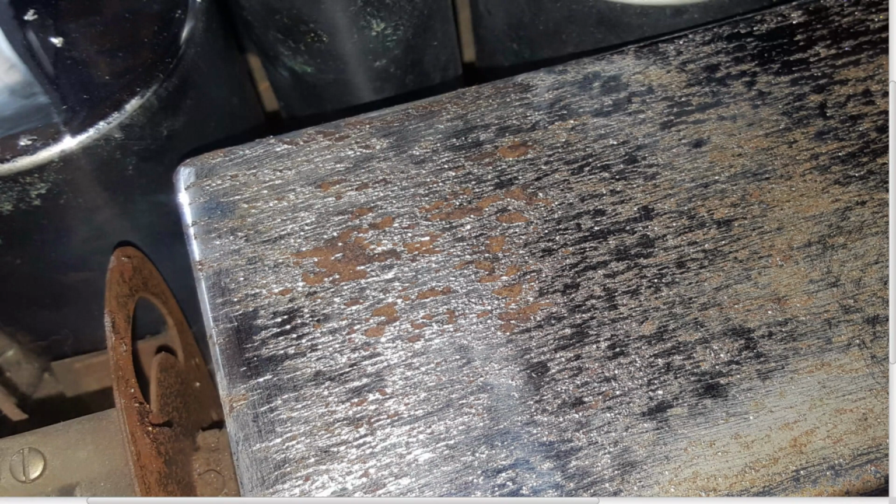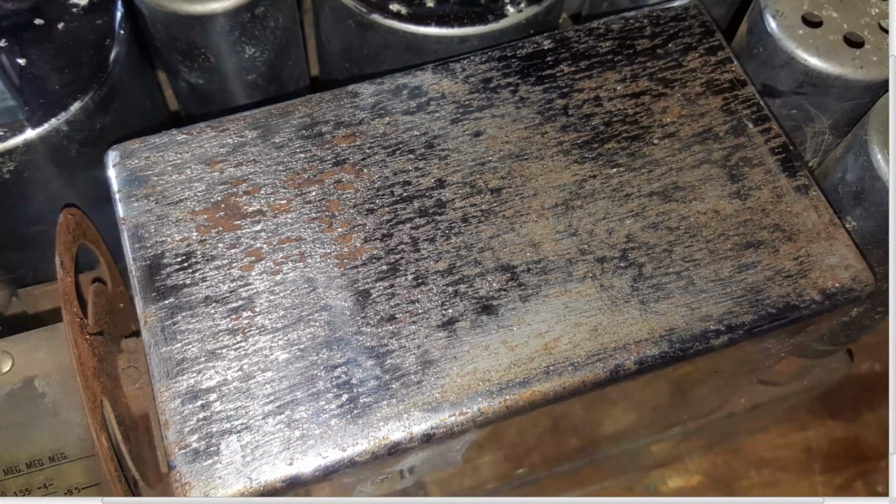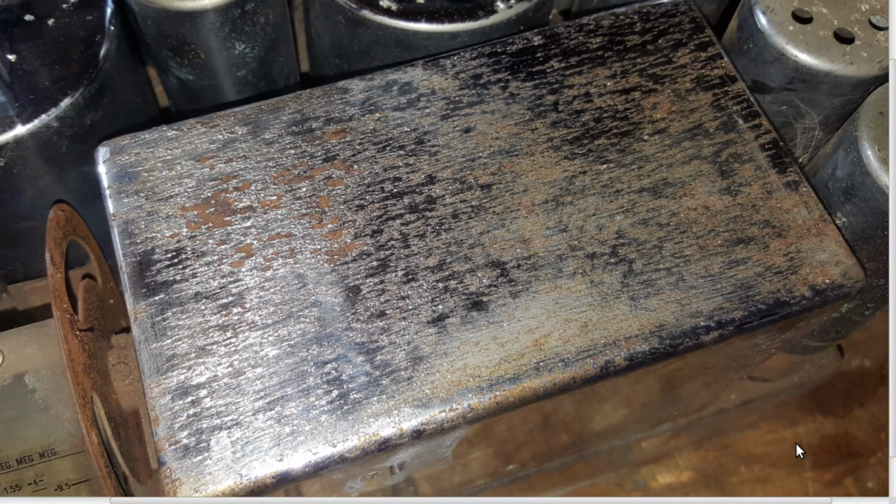And also I have questions. What kind of metal prep? How smooth does it have to be before being re-chromed? I have a feeling, guys, this is going to be a relatively expensive re-chroming job, because I have a feeling that the plating shop that I take this stuff to will have to do all of the metal prep, all of the metal work for me, meaning in areas like this, I'll have to pay them to do whatever they have to do to take the steel down to a platable surface, right?